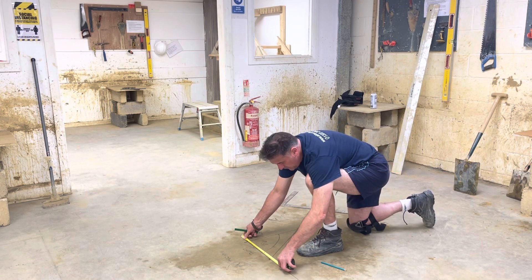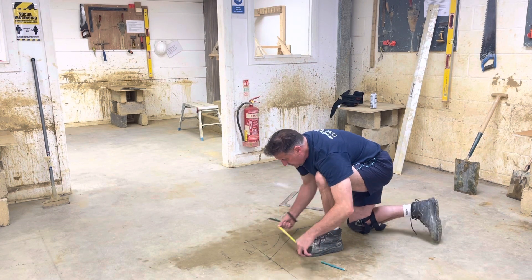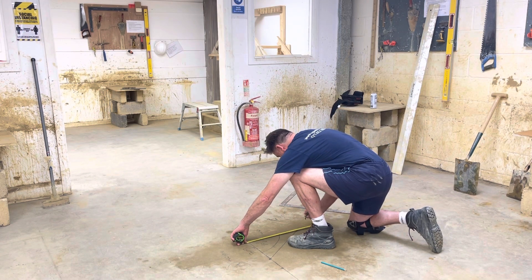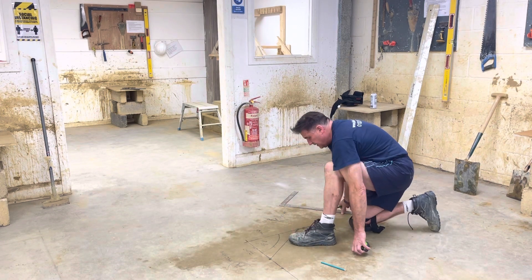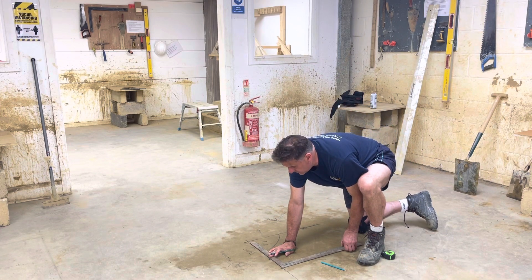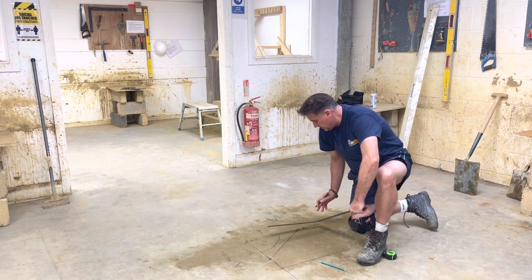Like we did before: mark the 540, check that it's 440mm lads. Same on this axis for B — put it on the 540, mark the 100. Arrow to that, so don't get confused with this one. Check that it's 440mm, which it is. Place the square on it nice and accurately, parallel to that line, and draw that axis in there. Same on the axis there.